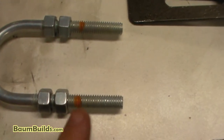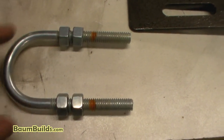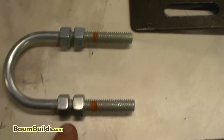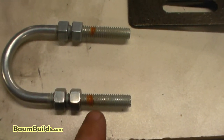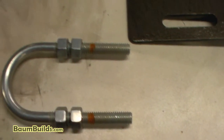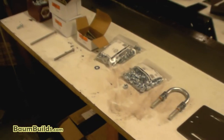One more thing with this: you'll cut these with a hacksaw or a cutoff wheel if you have it. But always run the nuts up past the cut before cutting. You can see how I had the nuts run up past the cut — so once you cut these off, when you back the nuts off it'll clean the thread, and then you'll be able to restart the nut.